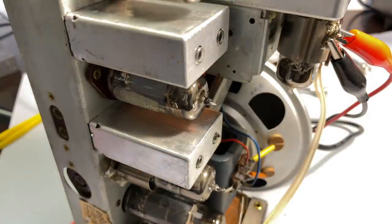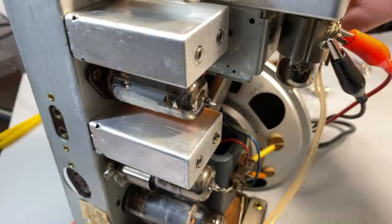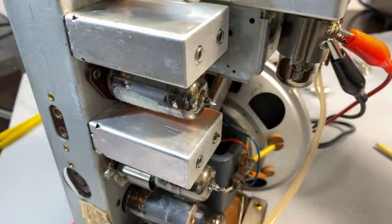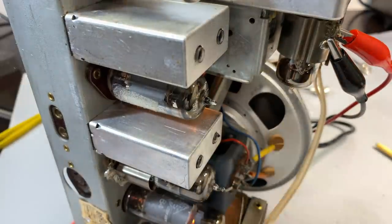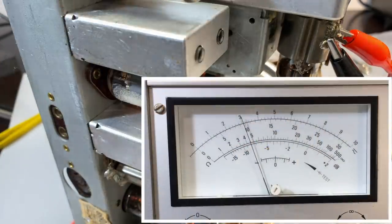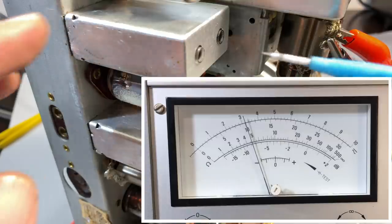Let me put on the radio. I've got a modulated signal on there because I don't know just how far off this thing is now. So I've put a modulated signal just to make sure we've got something. Still warming up. Volume's on max. And first of all, I'm going to tune off from the station. And I'll put on the signal generator. Yep. Loud and clear. Take off the modulation. And we've got our 10.7 megahertz signal coming in there. And let me try again.